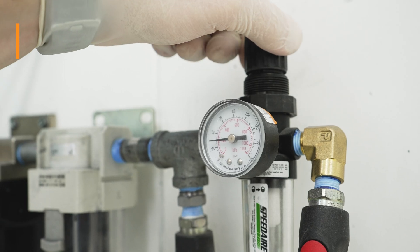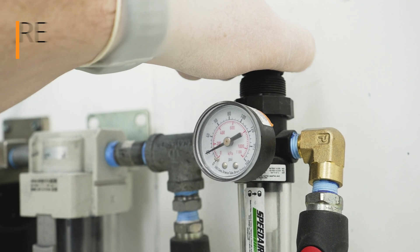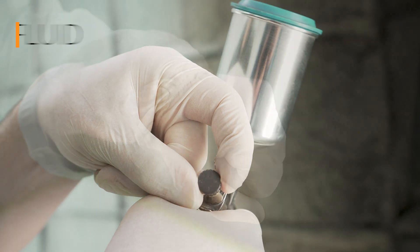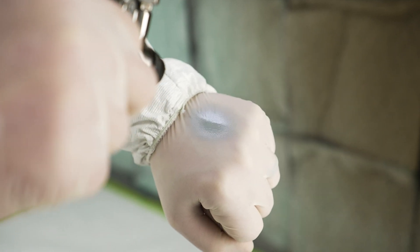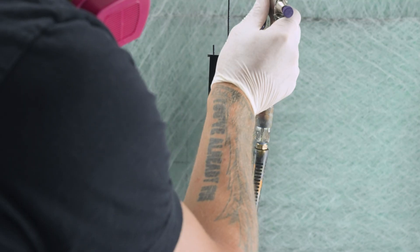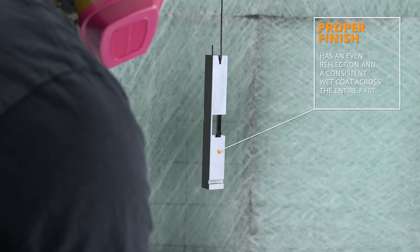To avoid dry spray with metallics, the two primary spray gun adjustments you can make are dropping the air pressure between 15 and 20 psi, and increasing your fluid flow adjustment. You can test spray on a practice part or on the back of your glove, and adjust until you see the coating is wetting out. When spraying your parts, it's very important that a wet reflection is visible on all sides of your parts. Using the side lights in your booth is a very helpful way to check for this reflection.